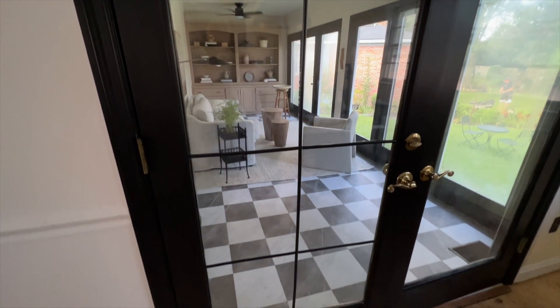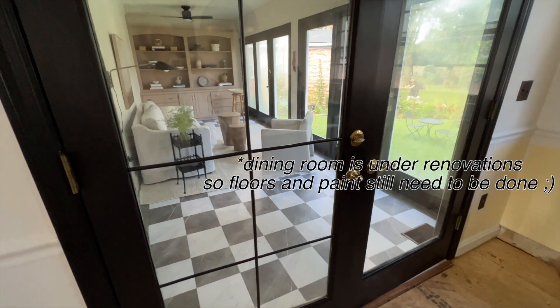Something I want to note: if you're going to do any doors or windows, lightly sand them for the best paint adhesion. I took a shortcut and did not sand my doors, but I highly suggest that you do lightly sand them so you get the best paint results and longevity — that's how your paint is really going to grip. You can totally prime as well. I skipped all those steps because down the road we plan on replacing these doors.